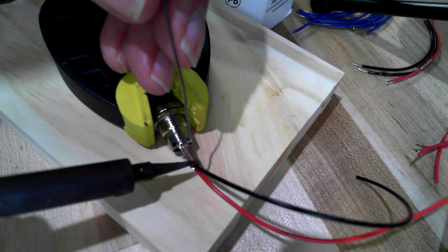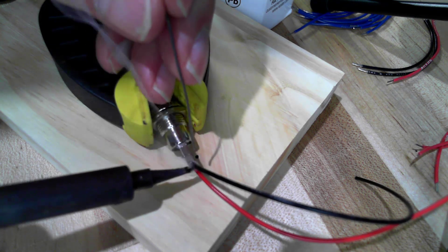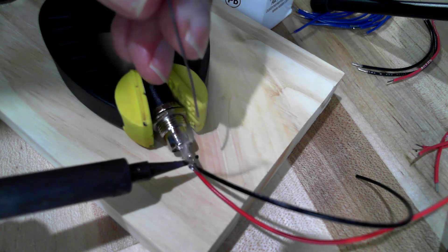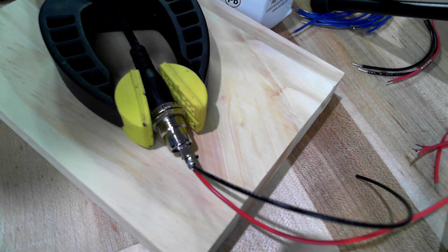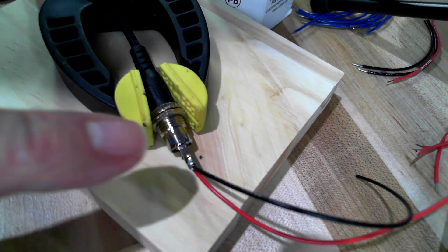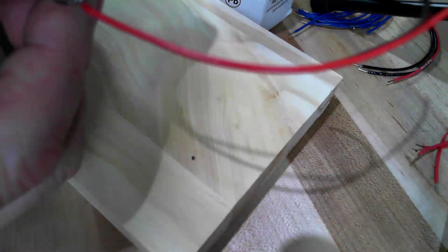Let's bring in a little heat and a little solder. This is somewhat awkward trying to do this for the camera instead of in the most opportune position. Get the heat in there, get some solder melting. You don't have to be too careful with this particular connection because it can handle quite a bit of heat, but make sure it's well soldered. Once it's cooled off the surface should look slightly less shiny — if it goes real dull, that means you've got a bad joint.